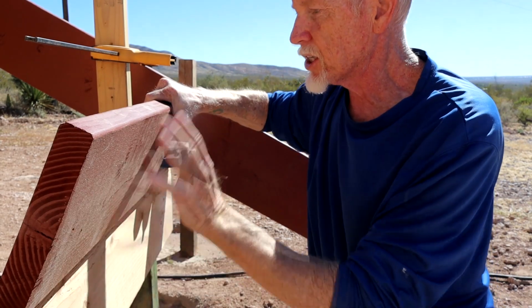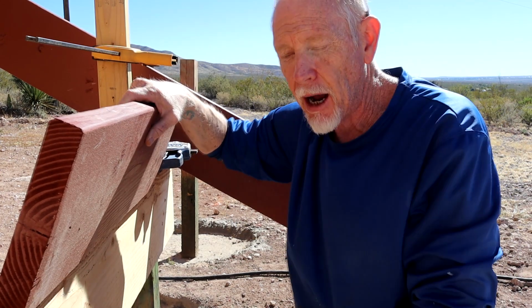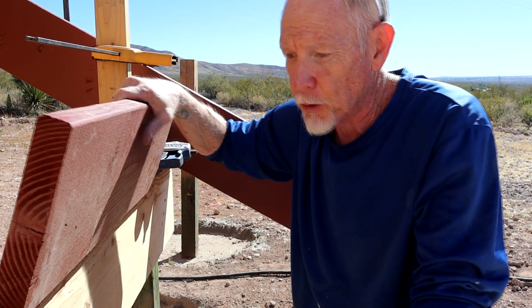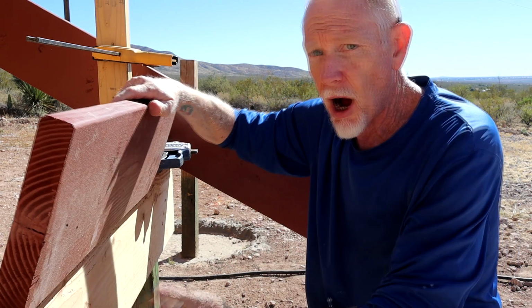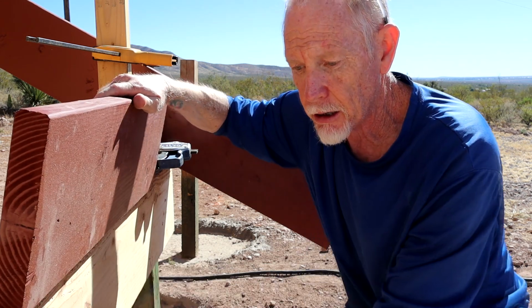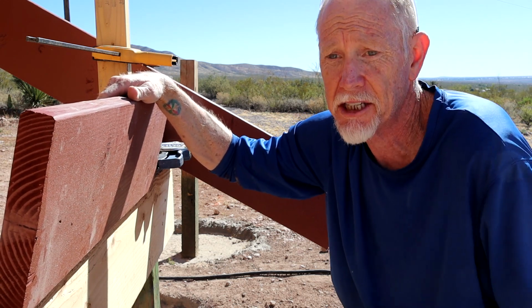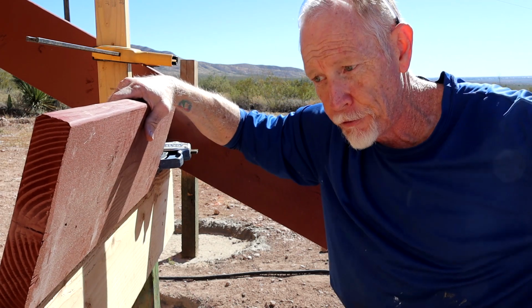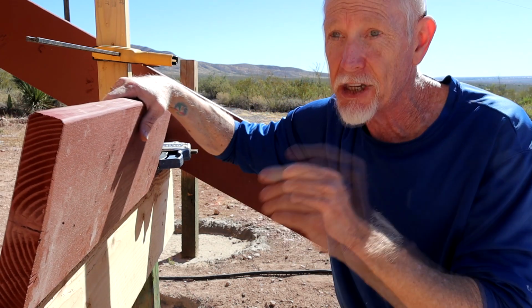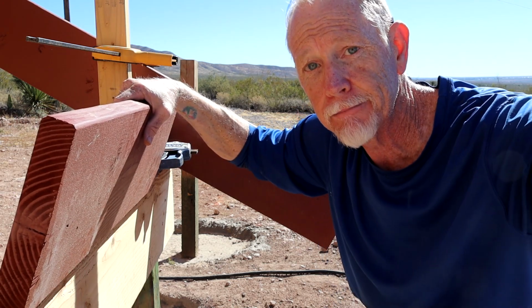And the nice thing about that is the solar panels will end here, and then because of the groove that I'm going to put on here so it sits down nice and tight, between some paint and some caulk, rainwater is not going to be able to get under there and then come back up unless the winds are strong, and it'll keep the wind out. And easy enough to caulk up quite a bit every couple of years. And then this is all going to be paneled siding down here so that this is an enclosed structure. Basically like a shed where the roof is a solar array. That's essentially what I'm building. So it doesn't have to be perfect, but I don't want wind getting in there. So wind tight is actually more important to me than water tight. So I'm trying to build and accommodate for that. I hope that made sense.